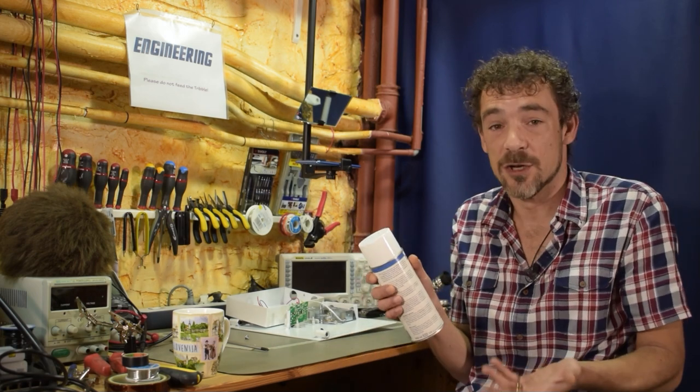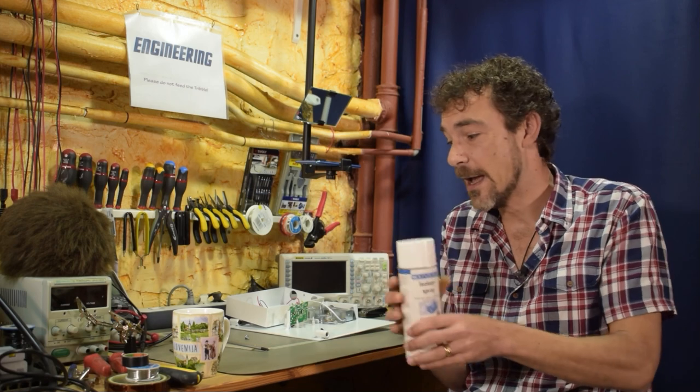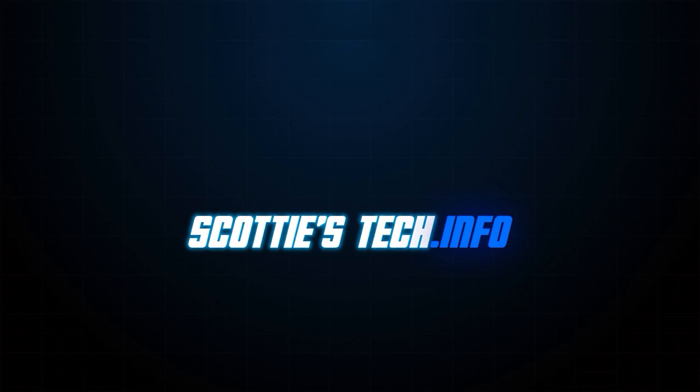That is how you can solve problems. Water is obviously kind of the mortal enemy of electronics, and in many cases, especially if it's a gizmo that's sitting outside in your garage or whatever, you can hopefully take it apart, give it a peek. I cleaned this off two months ago and it's been fine. There is no more gunk on here, but I know that probably within another few years I'm going to have the same problem again. So I haven't actually varnished this board yet because I wanted to show you what the problem was, but what I'm going to do is take my own advice and varnish this guy, put it back together, and Bob's your uncle. For more techie tips, see scottiestech.info. Thanks for watching, see you next time.